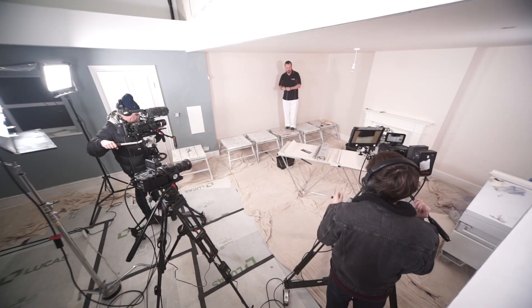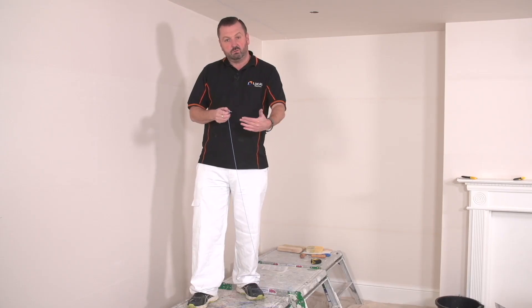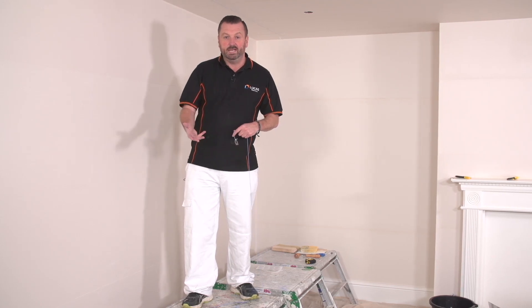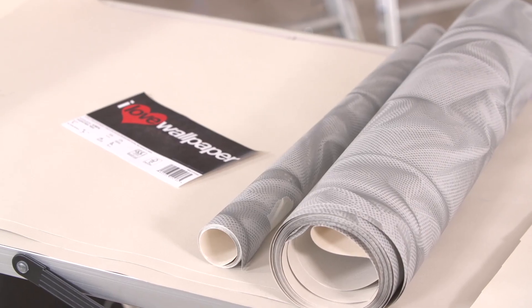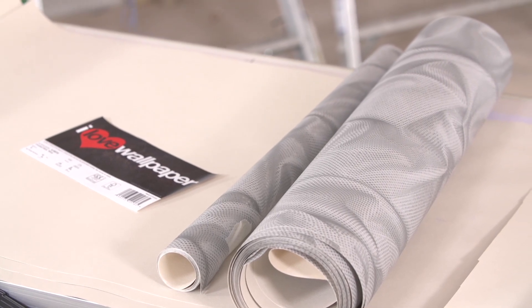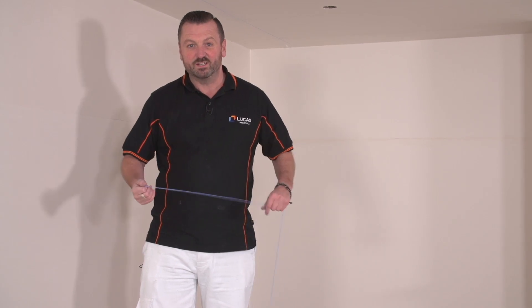Right, let's get one pasted up. I've got a two to four minute soak time, so if one piece soaks for four minutes then the next one soaks for four minutes. Don't get mixing them up or leaving them longer - this is where you get shrinkage on your gaps, overlaps, and all sorts of different problems. If one does four minutes, the next one does four minutes. A good paperhanger takes the time, makes a mark of what time it goes up. Right, let's get some pasting done.